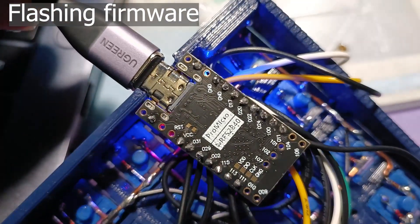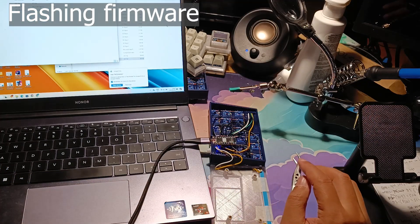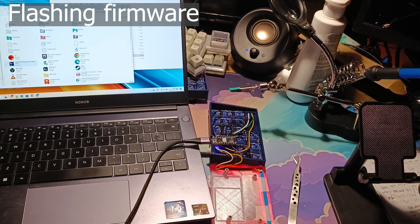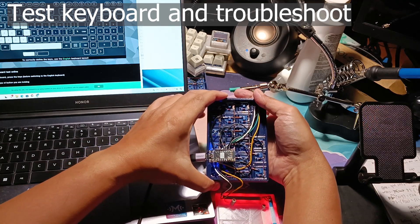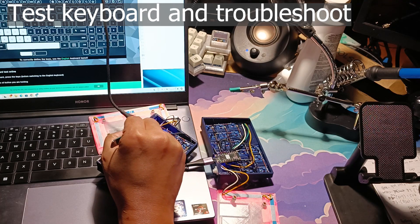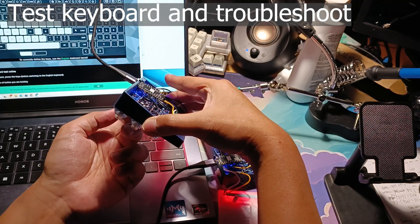Before connecting the battery and switch, flash the firmware onto the controller. Short the two reset and ground pins with tweezers twice in succession. The computer will detect the controller as a flash drive — drag the UF2 file from the description to the flash drive, depending on which side you're flashing. If the RGB light turns on, the flash is done correctly. Do a few tests to see if all keys register; if some aren't, there may be a poor solder connection on a column or row. Flash the other side, then to connect both halves wirelessly, reset them both with tweezers again but only once each — do both resets within a couple of seconds of each other and they should connect. Then test the keys on the other side.